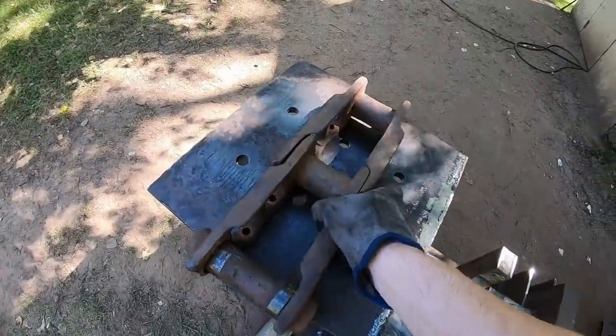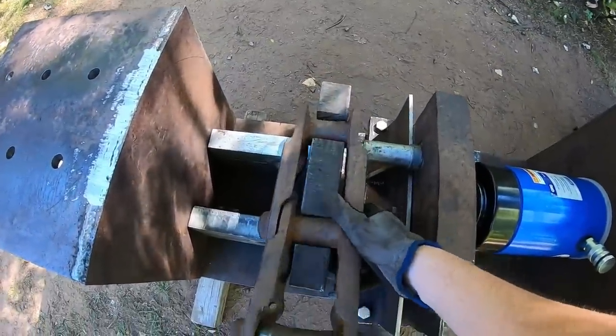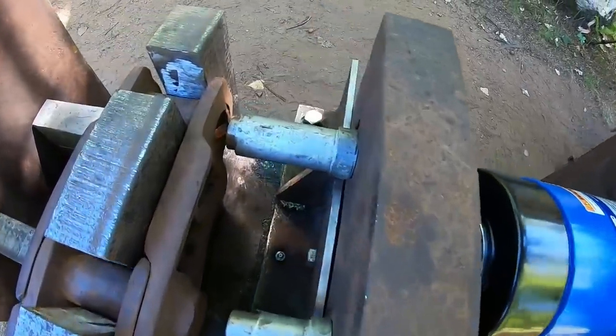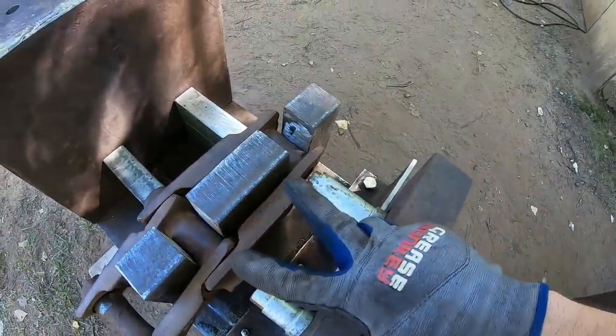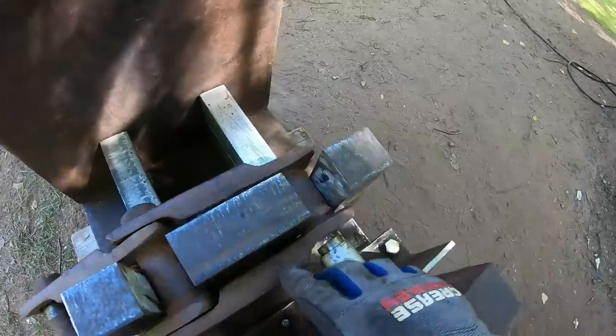Now the cradle for the track links. We have just this short section right here. We just slide the track link into the cradle like that, and as the hollow ram pushes on the heavy 2-inch plate, it will run those adapters, the bushing adapter up to the bushing there, the pin adapter to the pin right there.